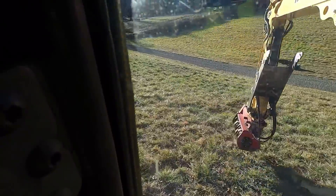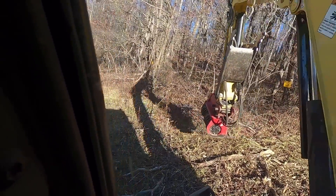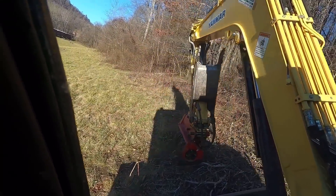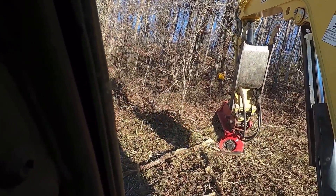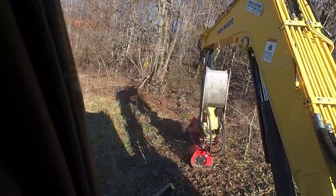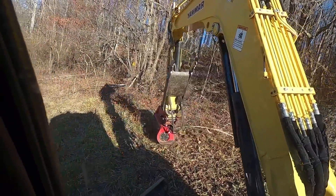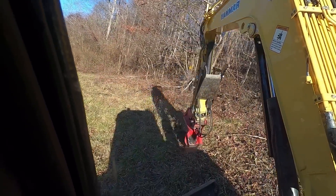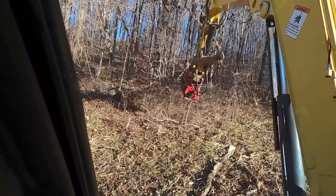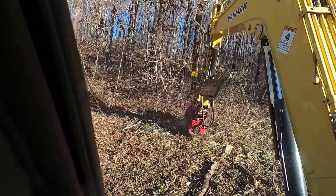You can see that road is not a long way from us. If you swing past right about here, it's hard for the machine to swing back up. So what I do is stay a little ways from the material I'm trying to cut — it's just like sweeping the floor. Better production if you put that head out from the machine so the swing radius is higher, and I try not to be as abrupt on the controls when operating.